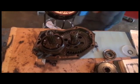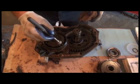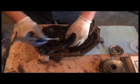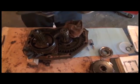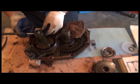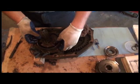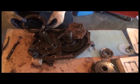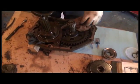You might find a magnet handy to pull these balls out. Otherwise, when you pick this up, the balls will go flying everywhere on your shop floor. Pull those out. Now we're ready to pull the cam right off. And as I suspected, there is no brake remaining on this power shaft clutch.